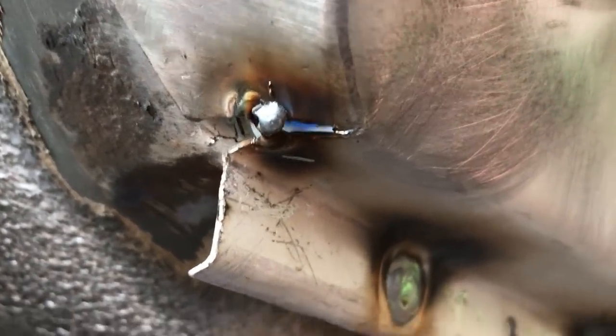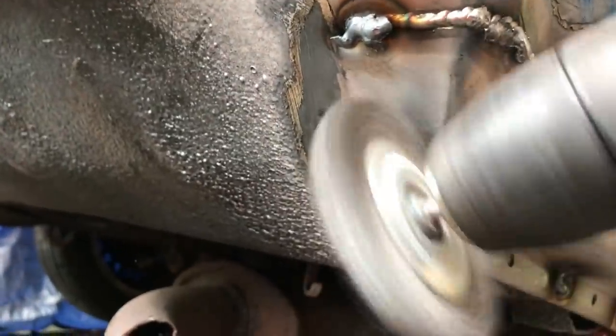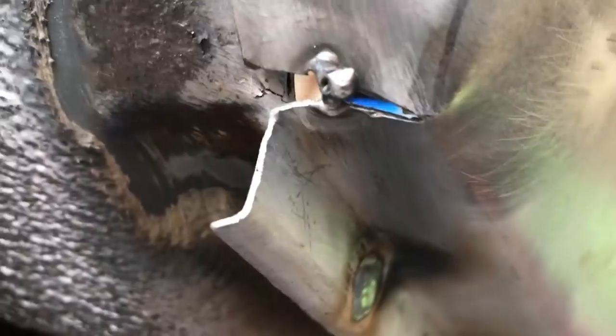Most of the welding is done. I've seamed in along the top. Some of it was super lovely and neat. Other bits, not so much. But it's on there, that's all done. Around the back here, I've dressed that corner, but I'm gonna have to fill in that bit. I've just thrown a tack across to act as a bit of a heat bridge. So I should be able to weld in the rest without blowing a massive hole.